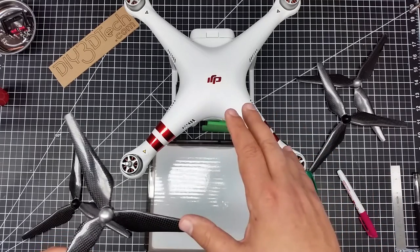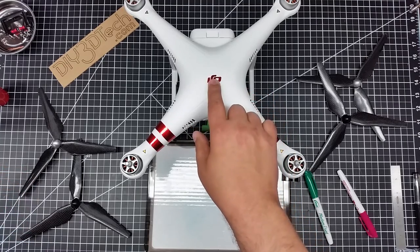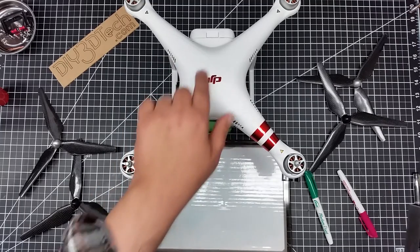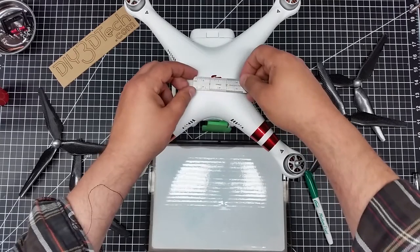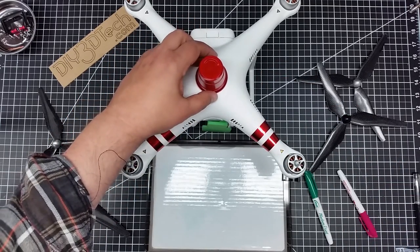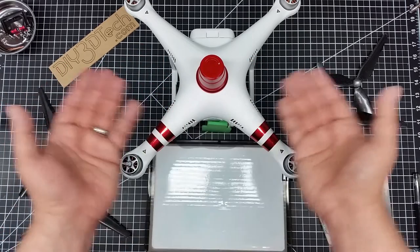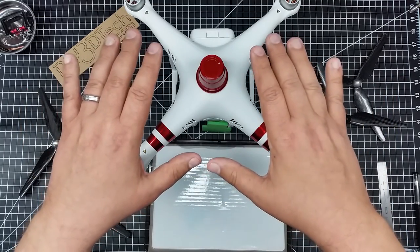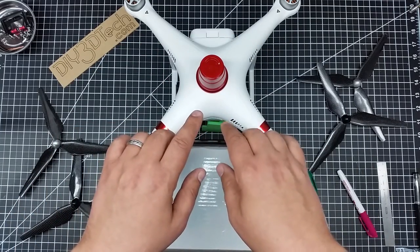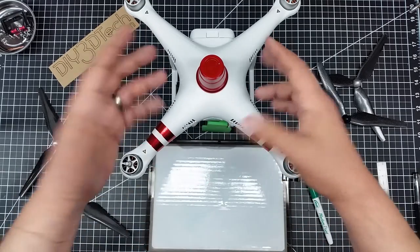The focus here is GPS and carbon fiber blades. The GPS antenna is about a two-inch disc located in the top of the fuselage chassis. I'm using a red plastic cup to represent that two-inch diameter — that's roughly the antenna receiving area for GPS. There's a foil underneath to create a ground plane and to insulate the antenna from the EMI and RFI radiation created by the electronics below, simply to create isolation. That foil is not the receiving antenna.